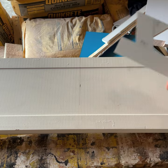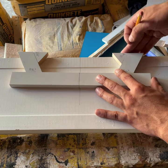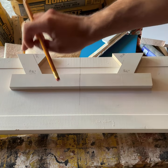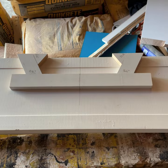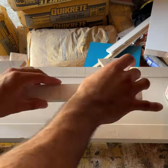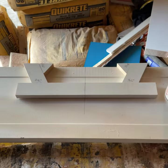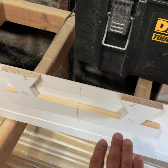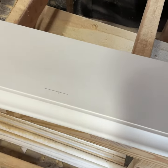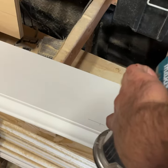Make a line and just line up the center of our jig with it, making sure the top is flush. Our pattern is centered, straight, and attached. Now we're just going to lay it down and hit it with the router and a flush bearing bit from the top.